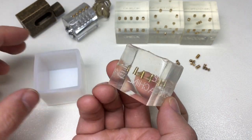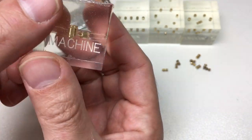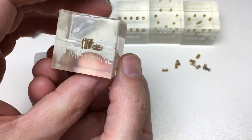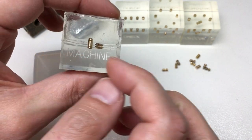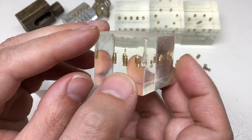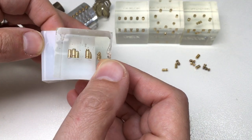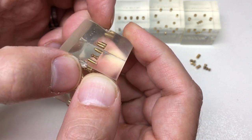Both of those failures taught me lessons — I hadn't done any casting before, so I learned a lot. They also gave me material to test engraving on the back, to see whether it looks better viewing through to the engraving or having it at the front. It doesn't look as good at the front, so we did them all engraved from the back. Another tip: don't over-pour. If you put in too much volume and too much hardener, you'll basically cook it — it'll overheat and discolour. You can see more yellow on top and less on the bottom — this one overheated. It also retracted and shows weird teardrop inclusions at the side.